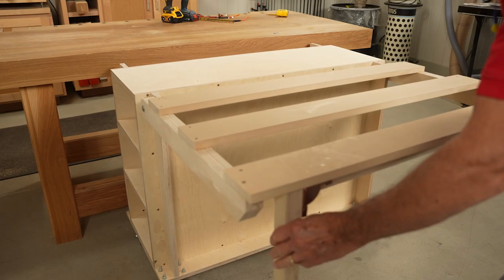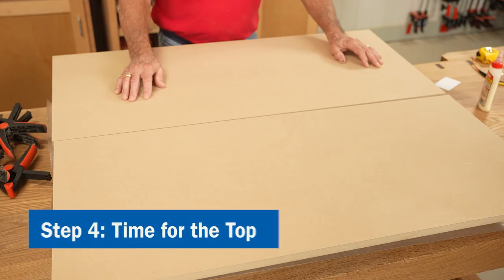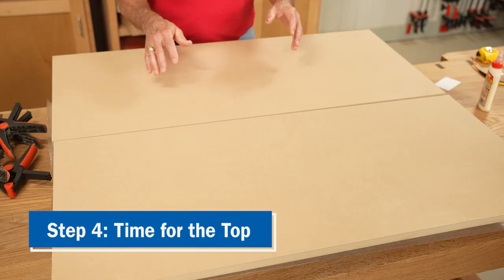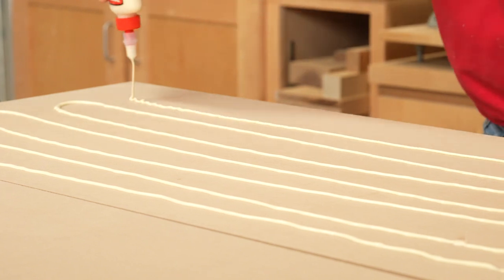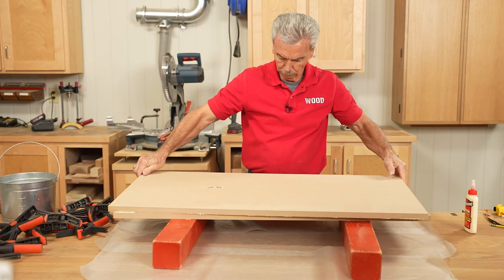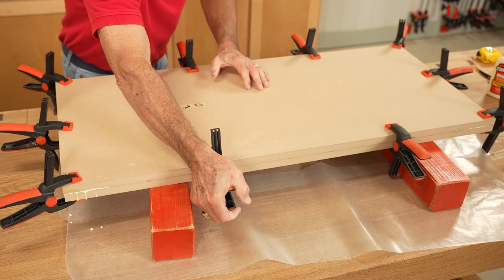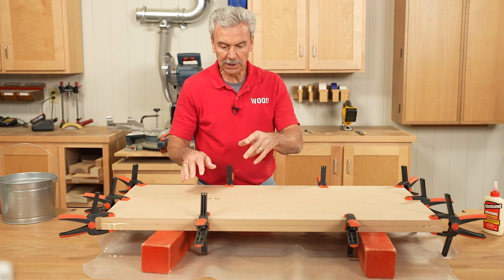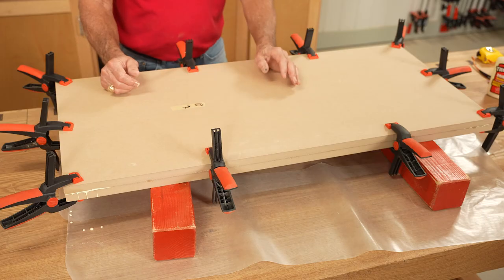It's now time to prepare the tops for both the drop wing and the table. The top of our outfeed table is an inch and a half thick, which means laminating two pieces of MDF together using regular woodworker's glue. The weight of the pieces would probably clamp them pretty well, but I'll put them together and add some clamps. I'll let them sit a few hours until they harden to get a really solid inch-and-a-half-thick top. With small clamps holding them in place I'll get some deep-throated clamps to finish the clamp-up. This will be ready in a few hours.